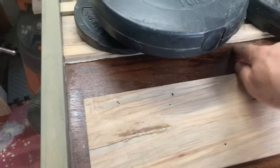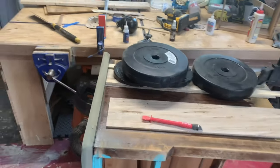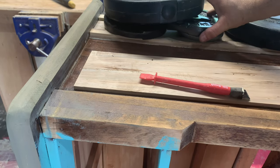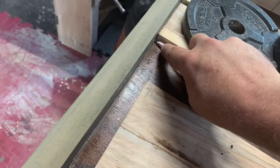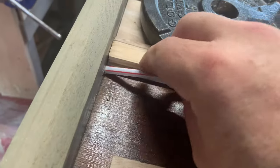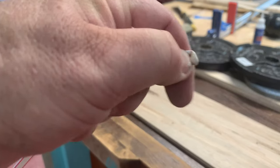When you do this, you want to pay particular attention to the edges — especially if you cut them at a flat 90 degrees. When that glue dries it'll prevent it from sliding right up against there. If you ever go into a woodworker's shop, you'll see it's just a regular drinking straw. You take your straw right along that edge and all your glue is gone. It's the best way to remove glue from the edges. If you want to save the turtles, you can just squeeze it out and reuse that straw.